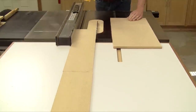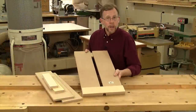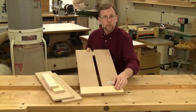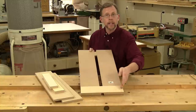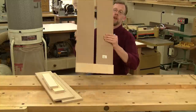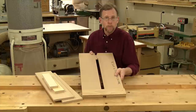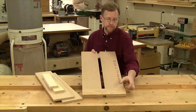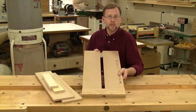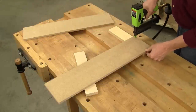As you already know, you're going to need a base for your jig. Make it from three-quarter inch thick scrap that's three inches wide and exactly 13 inches long. You're also going to need this 13-inch long bridge piece — it supports the platforms at the far end of the jig. I made mine two and a half inches wide. Start assembling the jig by brad nailing or screwing one of the platform pieces to the base piece, flush with its end.